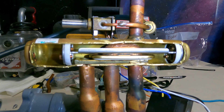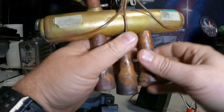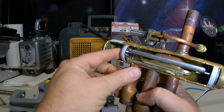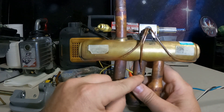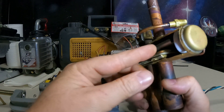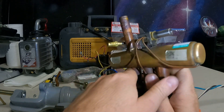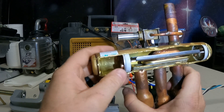Now let's see how this operates off of the capillary tubes. In here we have our discharge right here which would feed into this solenoid body. In the current position — which would be heating for this reversing valve — you have your common suction, or true suction, right here, allowing the suction gas to flow through here off of this port. This creates a low pressure situation on this side to allow the bellow to slide that way. When it's de-energized, your high pressure discharge is being pushed over to the other side, which pushes against a nylon seat that allows it to seal against the body.